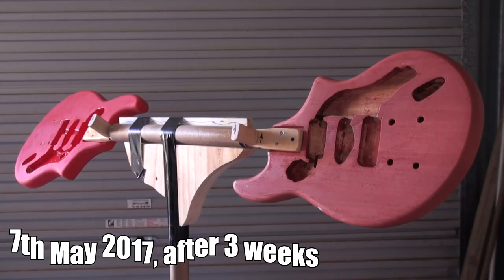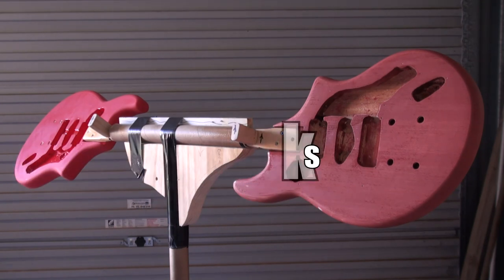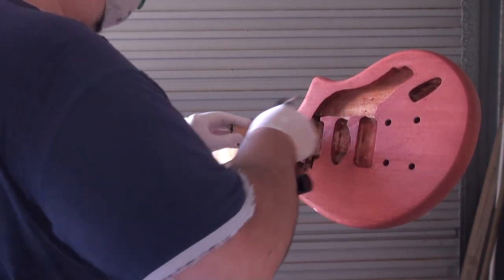Different shirt, different day, different sides. This was the second run of clear coating. I wet sanded the body flat except for where there were a few low areas, as I knew there would be more layers to come and did not want to risk cutting through to the stain in case it discolored the area.